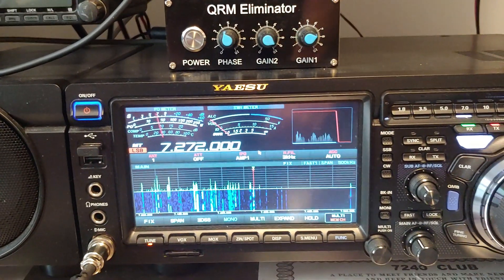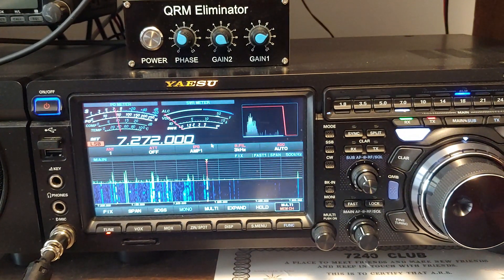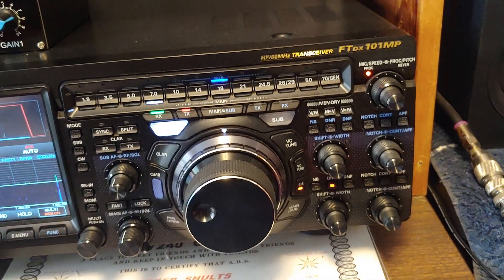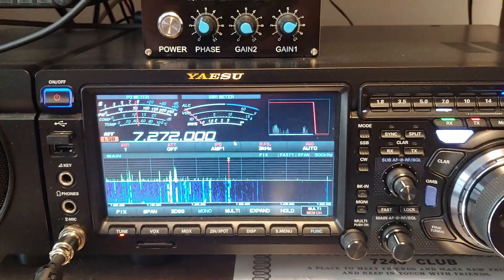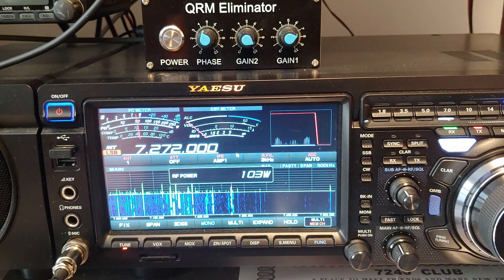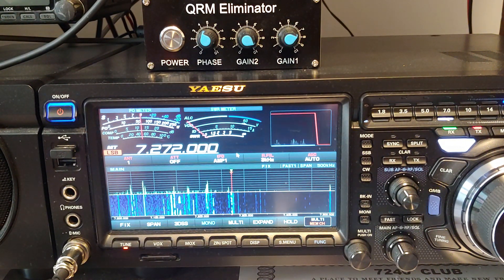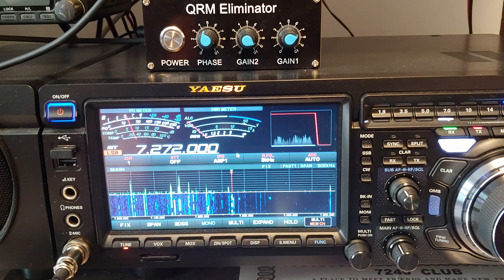The traps char and destroy. I've had that happen on at least four different occasions where I've put the antenna up. It works perfectly for about two or three months, then it starts becoming intermittent on receive. It still seems to work fine on transmit, but it quits functioning on receive. I have to take it down and refurbish the traps and try again with the same result. So I've given up on it.